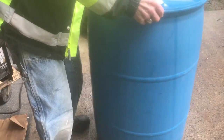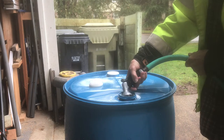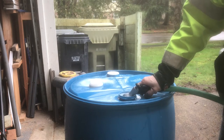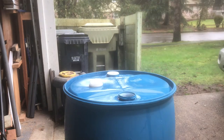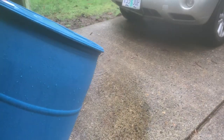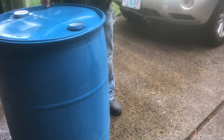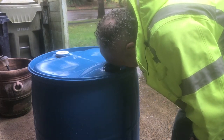I'll get my hose and spray nozzle and rinse everything off on the inside, going around to get everything rinsed down so all the little pieces run down the walls and sit on the bottom. I want at least a half gallon to a gallon of water in there so the plastic floats out. I actually did this a couple of times — I only showed it once on video but had a couple little pieces of plastic, so I repeated it. I looked in with a flashlight to make sure there were no pieces left that would end up in your water.